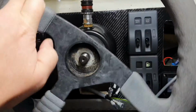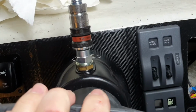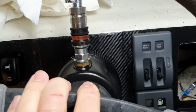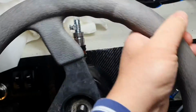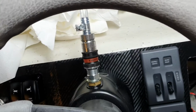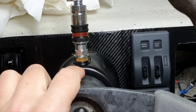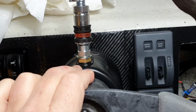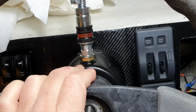It's quite simple. So if you want fewer turns, which I will probably want after my 2.4 mechanical steering, I think 5.4 is too much for me. I'm okay to have more tough steering. I have strong hands. So if you don't change the cylinder, you need to have a bigger pump. I actually wanted 22 initially, but it wasn't in stock. So probably I will replace it with 27 or 30 in the future.